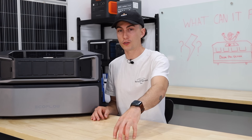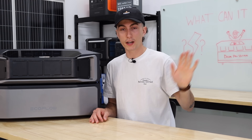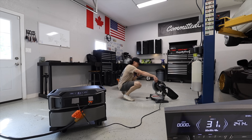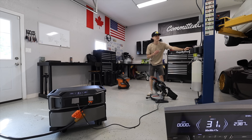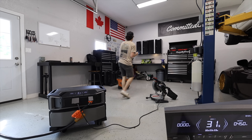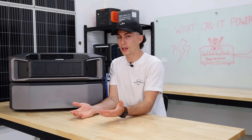When we didn't turn the compressor on, we could turn on the shop vac at 1,000 watts, turn on the table saw, turn on the chop saw — that was fine, everything was good. But when you go use the hoist, even with the compressor off, it surges aggressively enough that the table saw turns off. The unit internally tripped, which is actually good to know it does. It's just weird — it's almost like this is a little over-specced on the inverter and surge capacity and the F3800 is under-specced. This is never a perfect science and everybody's loads are unique to them.